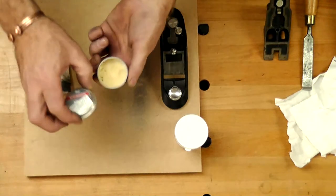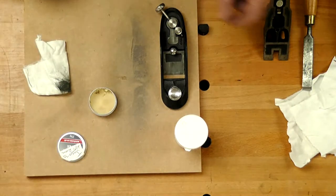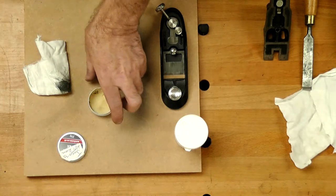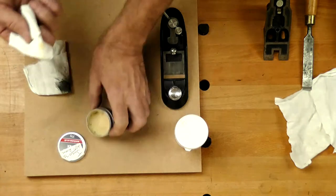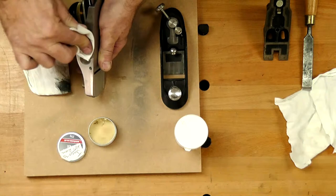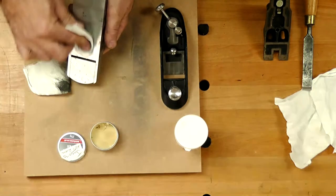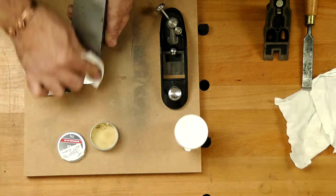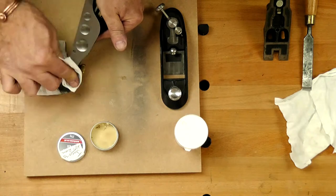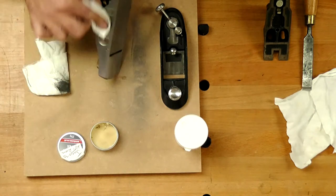We have a little tin of hand tool wax. This has got a special label. This says it's in here and it's my little tin, because Craig will vouch for the fact that things go missing from the rooms. People borrow it. Okay. So, easy to do as a wax. Now, this is building up a small layer. All right, I need to do a little bit more on the base there, clean up, but this will stop things going rusty. We can build up a layer. As we say, it doesn't contain silicone, so it's not going to affect the timber.